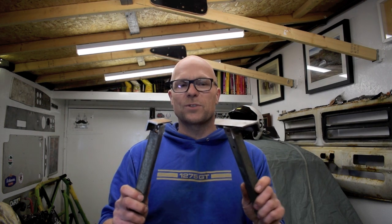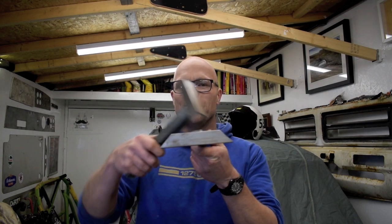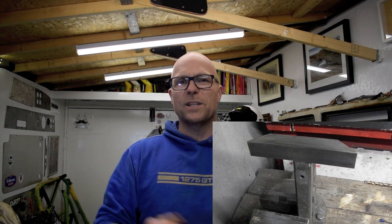I'm really sorry, I didn't show you how I folded the box together. How did I do it? Well, in the end I made these little tools — they are basically just pieces of angle iron that have got the right angle for the corners. I stuck them in a vise and then using a hammer, I just formed it over the top. Sorry, I'll show you next time.